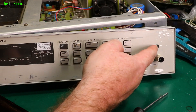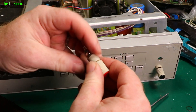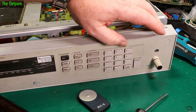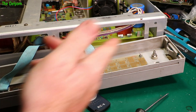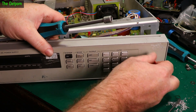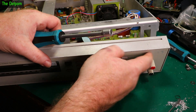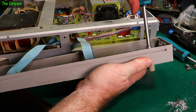So I've drilled out both holes — there's a 7.5 millimeter hole in this particular case for these particular binding posts. They've also got a little lump on the side, two little lobes which are supposed to lock into each other, but in this case because the plastic is so thick it won't do that. I've tried to cut those in as well with a smaller drill bit, and I've also got the bottom one already installed. I have to do the same thing with the top one and then I can refit it and look at wiring it up. A little note: if you ever use this particular type of binding post, make sure these aren't tightened down because as you tighten them it actually pulls the metal insert in slightly, and if you have that tightened down there it'll actually lock up on the nut and not on the body of it. Make sure you've got it unscrewed a couple of bits and then you can lock it down fairly securely — you don't want it to move.